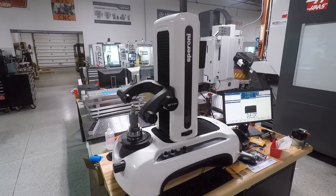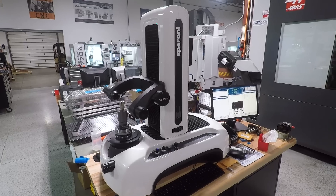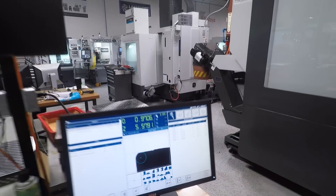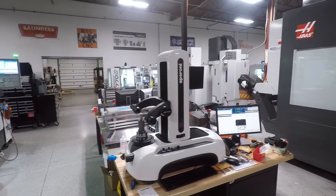A lot of people use these to set up a whole bunch of tools offline — you don't need a tool setter in your machine. When you set the tools up, you can save them, create a list, and then just click post, and it will post a program to your machine. You hit cycle start and it updates all the tool values. But for me, this is a lot more to do with measuring total indicated reading on runout — looking at edge wear, tool quality, really getting scientific about that, which ties back to the new company we're starting around tooling and speeds and feeds. The capabilities are just absolutely amazing.